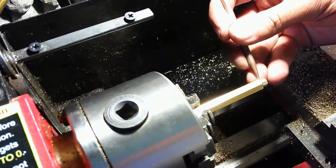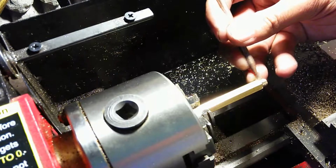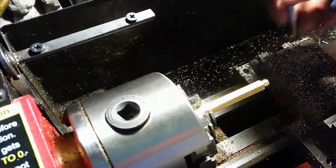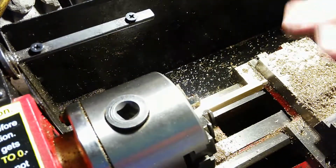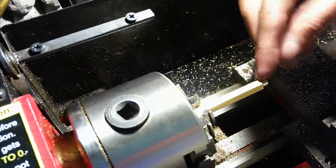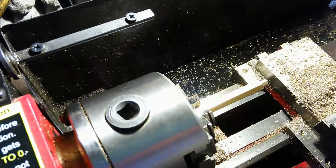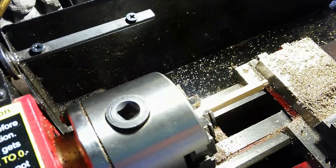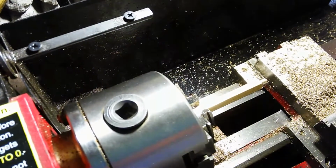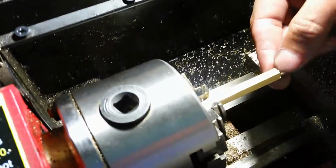So I have a tolerance. I know how much thread I'm supposed to have here, but I also have a spec for how much distance there's going to be from here to the bottom edge of that, and it's going to vary depending on how angled the cutter is going into there. So usually for the first cuts, I'll go to the maximum of that depth, and I'll start there, and then I'll back it out, usually about 3 mil every time. It just depends on the average of the cut, but the first few cuts I do to that actual edge there, and then as I go deeper and deeper into the material, I back it out more and more in that direction, so that I end up with a beveled edge.